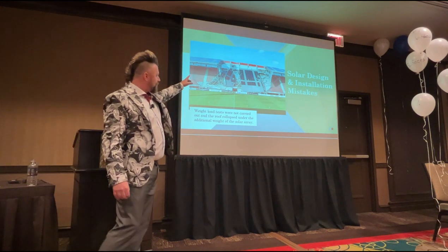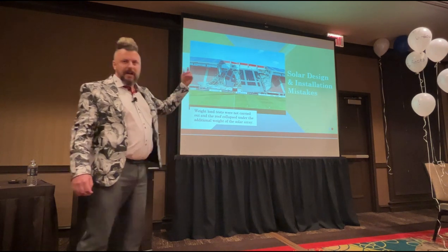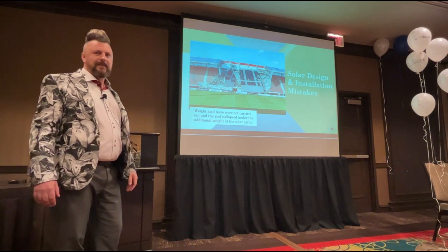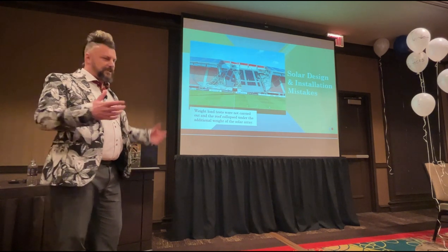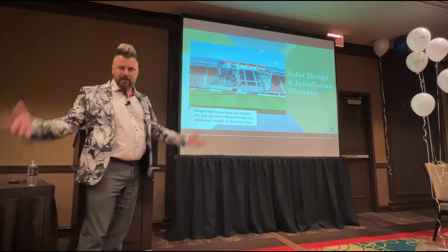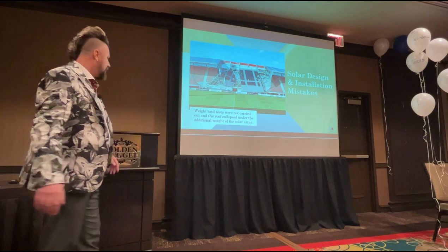That's pretty unusual because there are no support structures, are there? There are no vertical uprights. So in that instance I'd be saying, look, there are no verticals here. Can I walk around on that roof? And how much water? You think water's heavy, isn't it? You've got 200 or 300 meters of hose on there, and you put an extra 200 kilograms of water on there. All of that needs to be taken into account.